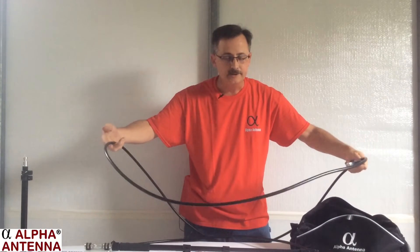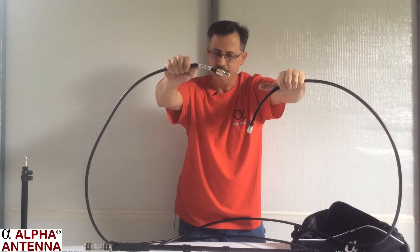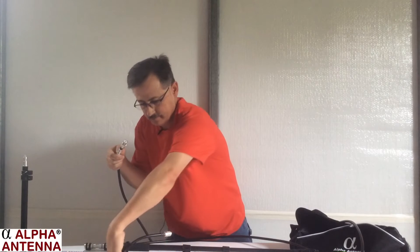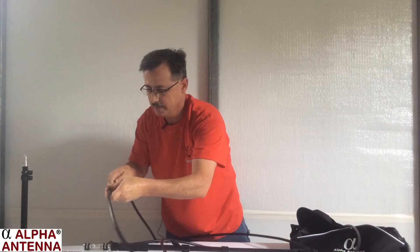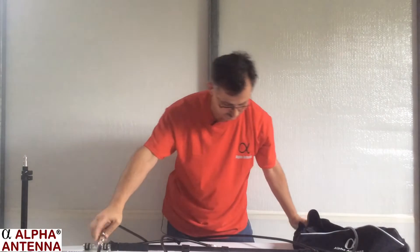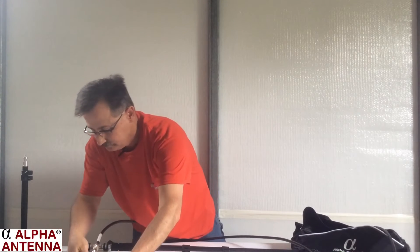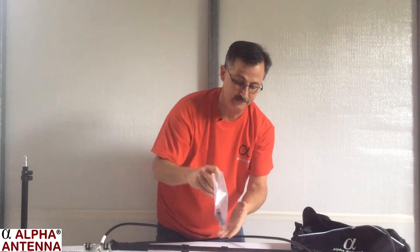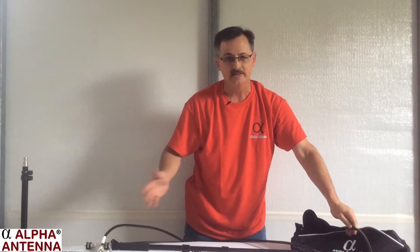It's easier to do this on a table or you can use the ground. Notice that on the booster cable there is a barrel connector. That barrel connector is going to connect to the PL-259 that we removed from the Alpha Match. Go ahead and connect those together — we only have one end that's loose, and that end is the other end of the booster cable, which goes into the Alpha Match. Once it's inside the Alpha Match, screw that securely. We've included extra nylon insulators in the bag; these extra nylon insulators enable you to more easily position the coaxials that are now forming two loops.